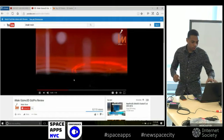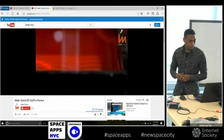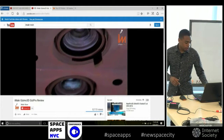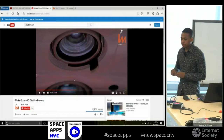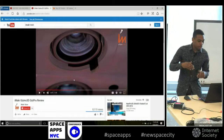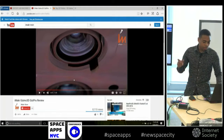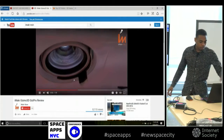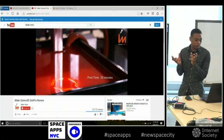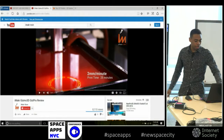In this case we're going to be using a projector. The great thing about using a projector is you can project each layer — you can have multiple objects on each layer and it doesn't change the time because you're not worrying about a laser going piece by piece. You can see the object being built out of the resin. Those highlighted parts you see are the resin being cured as it goes.